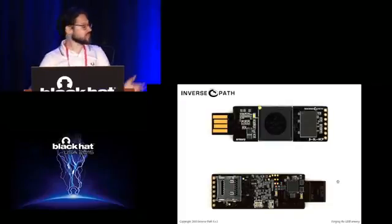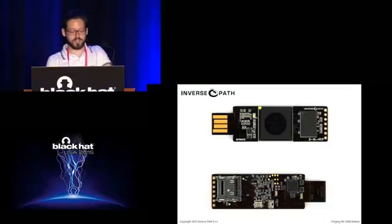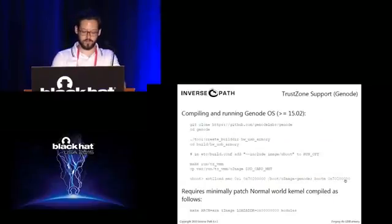The final design has the SOC in the center, the RAM, the pin header, and on the bottom the microSD card slot which provides the OS. There's no other persistent storage except for a few fuses in the SOC for signing keys — no BIOS, nothing that can be flashed. Everything boots from the microSD card, which we think is a good security property.